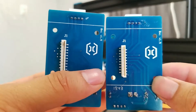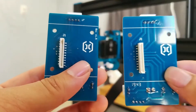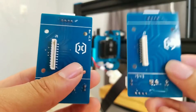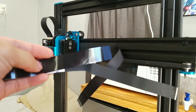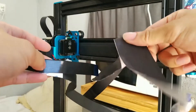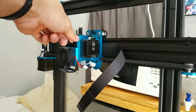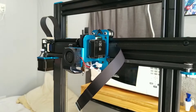Flipping it around, we have the ribbon cable connector here on the front. Now comparing two identical boards — on the left you can see that it's visually burnt, and on the right side you can see there are no burn marks on the connector part. So here's how I like to do it: I have the ribbon cable on the left and the tape on the right. Instead of taking the whole extruder end off, I slide it all the way over to the right and then take the old one off and replace it with the new one.